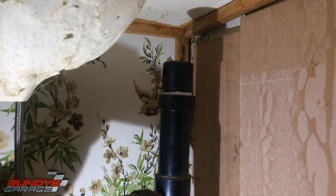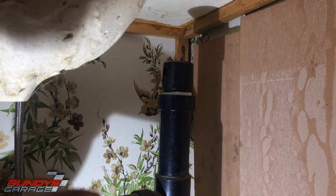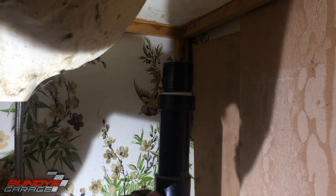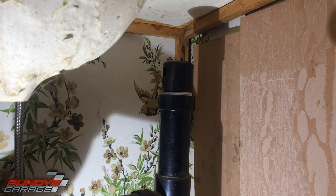What you're looking at is an air admittance valve. It's basically a one-way check valve and it sits under sinks. It's part of the plumbing situation. If you have an island with a sink, it probably has one of these. In mobile homes and manufactured homes, you're going to find these as well. Most of your tubs will tie into the sink for venting, but this sits underneath the sink. And what happens over time is these things go bad — the air admittance valves go bad.